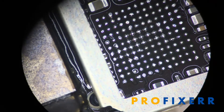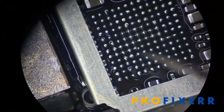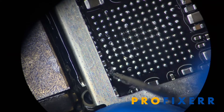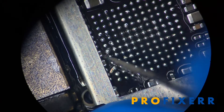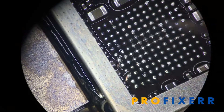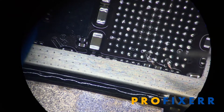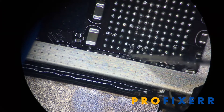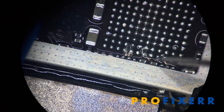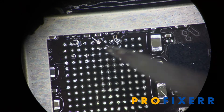After we remove the chip and prep all the pads with new solder, we go ahead and scrape the trace. Basically, C12 is the main one — that's the one I was working on first. C12 basically becomes severed, even microscopically. You probably couldn't even see it if we zoomed in on the microscope. It becomes severed or damaged in a way where it's not communicating correctly with the chip itself, and so we get that error when trying to do voice memos.